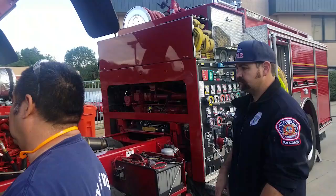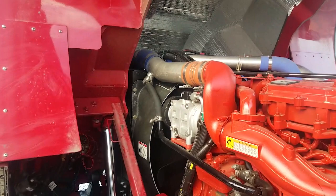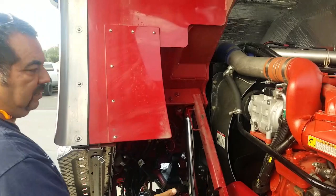Drop the cab down until you can't accidentally knock your safety prop out of position — that's why guys grab it just enough to catch it. You can't take it out just by bumping it, but if you accidentally come through in a rush, the prop falls down and it's not in place and you don't realize it. Once you get it down, make sure you have clearance between the safety prop and the cab structure. Grab the stop, make sure it can't come out easily, and then you're good.